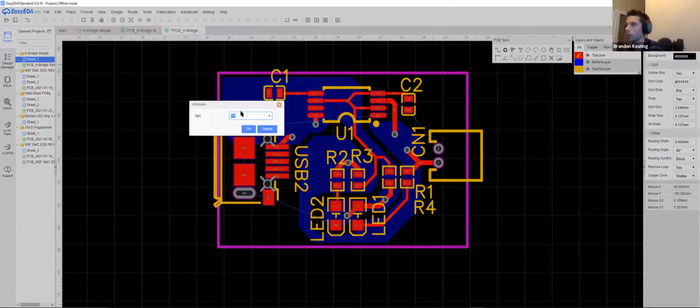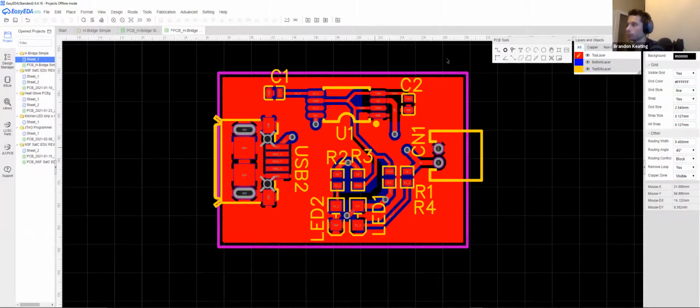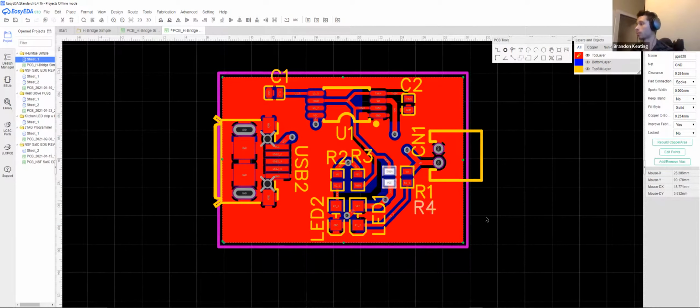And there's only one more copper layer to add, and that's going to be the ground layer. I'm going to do this right up top. And I can just essentially outline the entire board. This does not need to be a particular shape because I'm not going to put any other voltage up top. So as of right now, this will work.